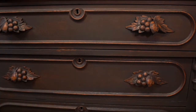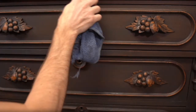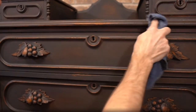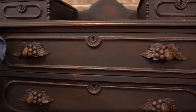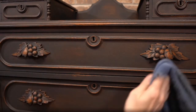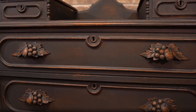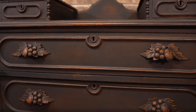I usually do topcoat. I would use something that's not glossy — if you're choosing Dixie Bell topcoats, don't go glossy; go more of a flat or satin. Definitely don't do glossy. Not that glossy wouldn't work, but it's like why distress if you're going to go glossy? Another option: maybe after it's cured really well, you could try hemp oil and see if that would be a good solution. I've not done hemp oil for chalk paint yet — I just haven't really put my test to that, so I don't want to mislead you.